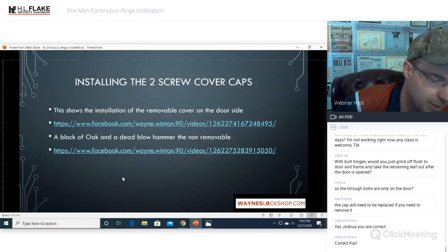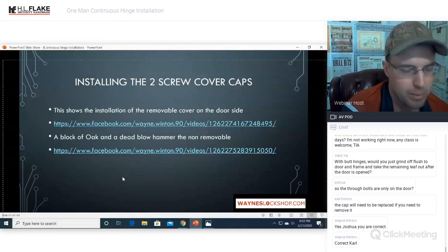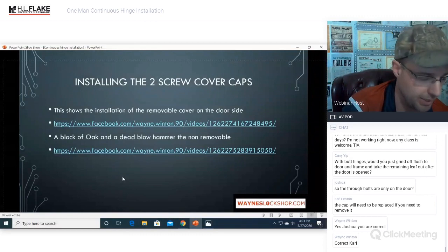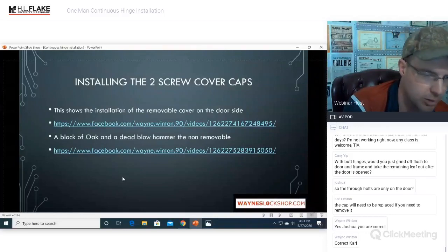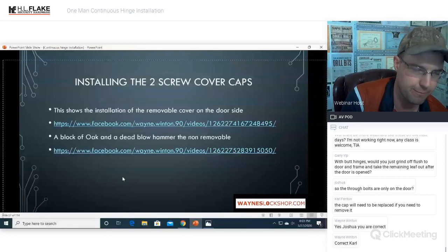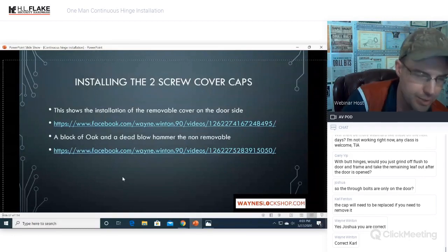This also comes into play when I go and fix hinges that are improperly installed. How do I say this nicely? Most companies that are dedicated glass companies in the area where I am do not know how to install these hinges properly, and a large portion of my business is going and reinstalling the hinge that they installed later on down the road. I've had videos where three self-tapping screws were used on the frame side, no through bolts were used on the door side, and four self-tapping screws that were all stripped out were used on the door side. Absolutely no through bolts were mounted.